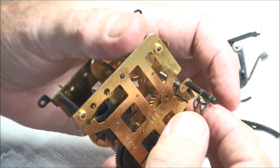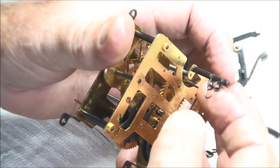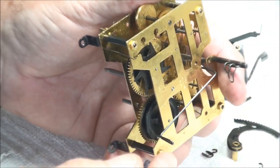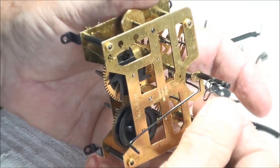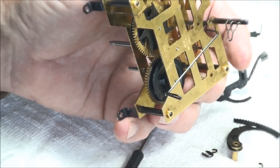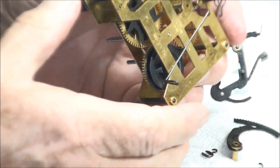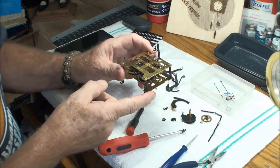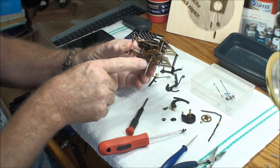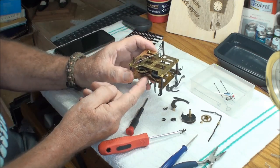Checking this — it looks good, it's open. Normally 'open' tells me it hasn't fallen on the floor. Usually when they fall on the floor the pendulum crams up in here and shoves this hard enough — especially on a heavier weighted clock — that it'll twist closed, and then your pendulum will start swinging incorrectly. There's a chance if it swings badly enough, the pendulum could hit the weights. Let's get this onto the legs. I want to put it on the legs because I have this shaft here and I don't want the movement to fall apart, especially for new people.